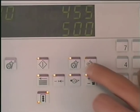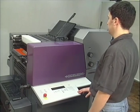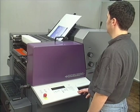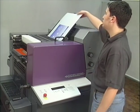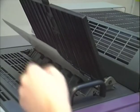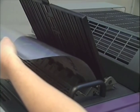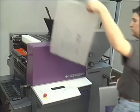The auto plate function activates automatic ejection and insertion of the printing plate. Ejection will be activated if there is still a plate on the plate cylinder. The position of the plate feed table defines the printing unit in which a plate will be changed. Move the feed table toward the delivery for changing the plate in printing unit 2. Now you just have to push the button for plate change twice quickly and the plate cylinder will move to the plate clamping position.